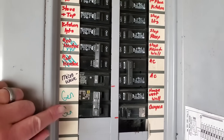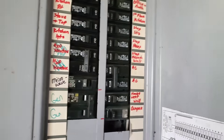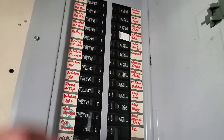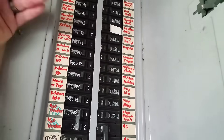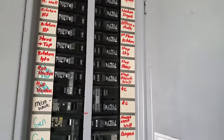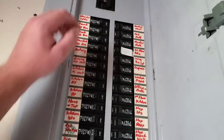On the 30 amp breaker I have hooked to my generator receptacle outside, you can see I've labeled it 'generator.' We can go ahead and safely turn this on. Now we have power to our breaker panel. The first thing you want to do — and I've got mine marked — is turn on the inside part of your air conditioner, your attic blower, first. That'll get your attic fan running. Next, turn on the compressor for your air conditioner. My generator took the hit and my air conditioner is now running. Now I can come in here and turn on all my other loads.